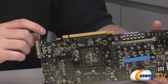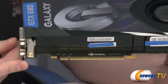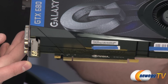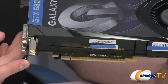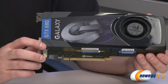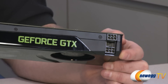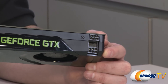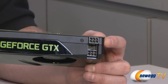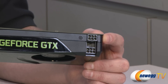This is your PCI connector — PCI Express Generation 3 compatible, and also backwards compatible with PCIe Gen 2 or 2.1. Gen 3 gives you roughly twice the bandwidth of PCIe Gen 2. But don't worry if you have a PCIe Gen 2 motherboard — it's backwards compatible, and you really don't have enough data moving between the card and CPU to saturate even the PCIe Gen 2 bus. For power, two six-pin power plugs are all that's required. The card has a 195-watt TDP, doesn't require an eight-pin connector, and a minimum 550-watt power supply is recommended.